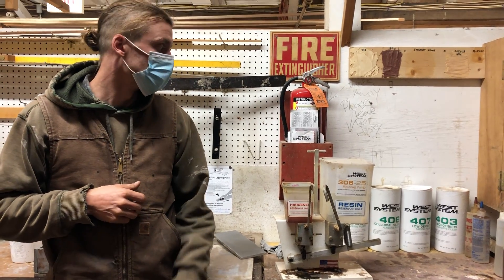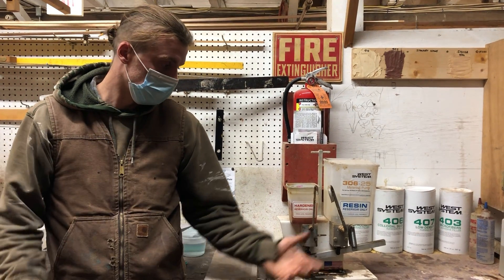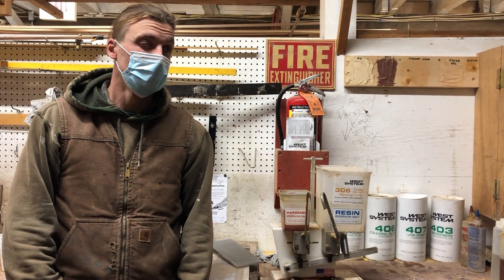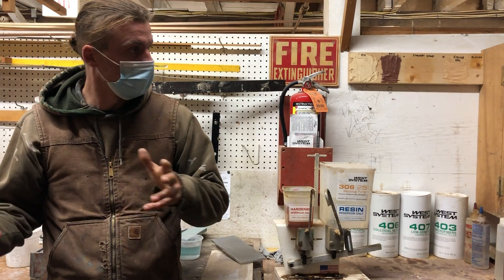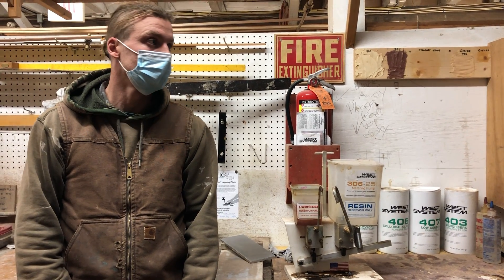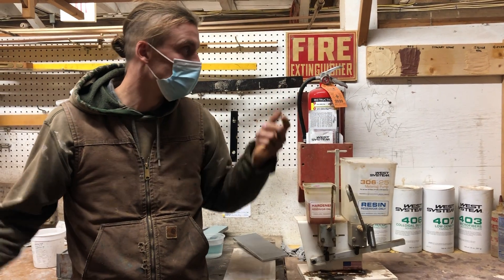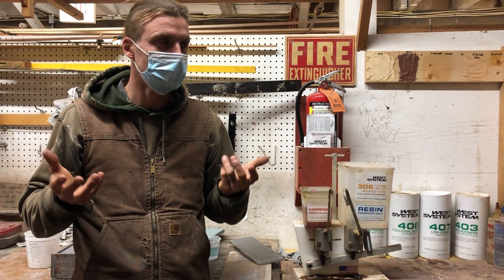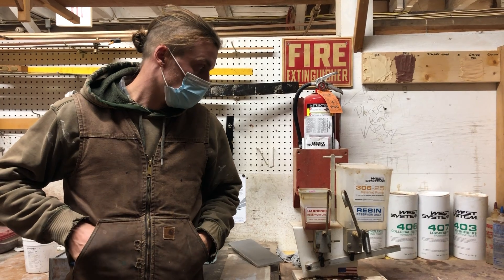This is a cohesive system with all the bits and pieces you could need. There's a whole bunch of other stuff out there like System 3 and Total Boat and a wide variety of epoxies. My understanding is that a lot of these epoxies evolved from aircraft construction to boat building and the use of really lightweight high-grade laminates. I started using West System — West stands for Wood Epoxy Saturation Technique — and they're basically making boats that are not very far from being a fiberglass boat, but with wood as a matrix instead of fiberglass.